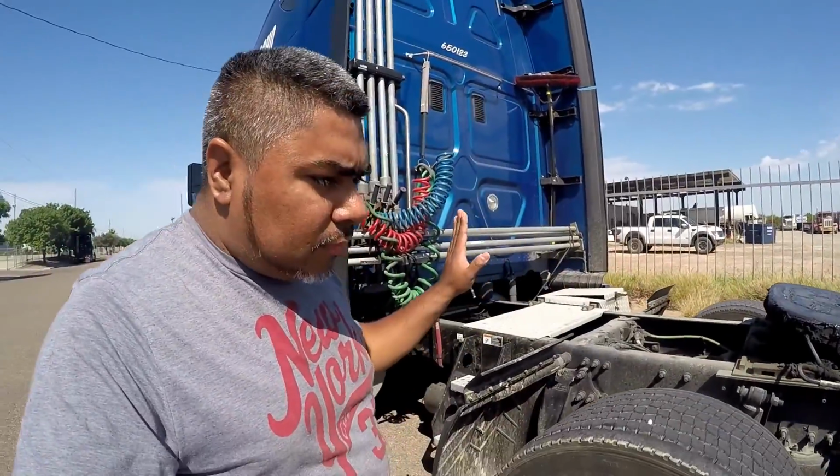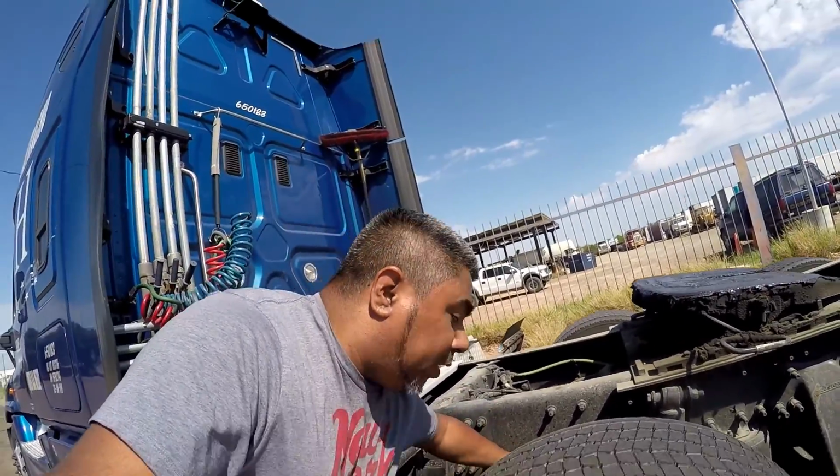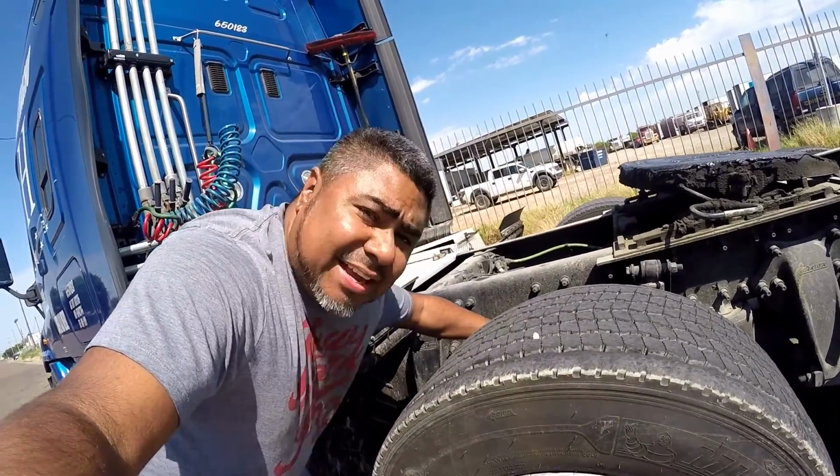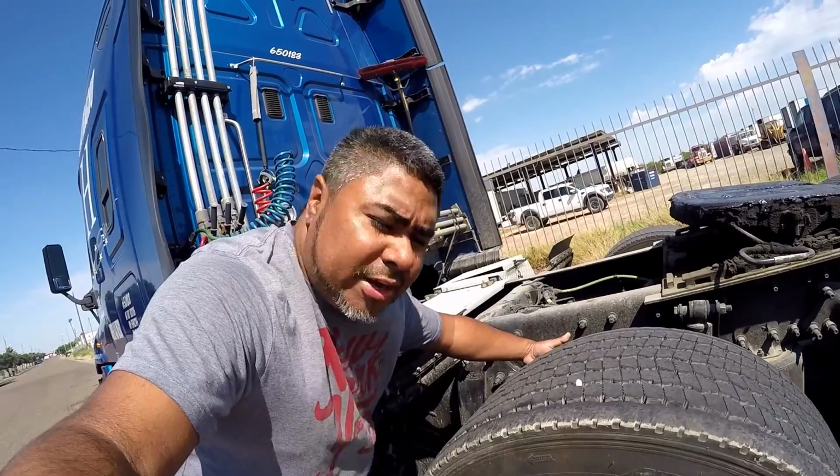You come back out here, you're going to be right next to the trailer, and then you're going to be talking about the brake drum, the brake lining, the drive tire. Then you're going to be talking about the rim and so on. Brake lining, the brake drum, make sure it's properly mounted, secured, not cracked, bent, or broken. As long as you point, you can point down there inside, he'll know you're talking about the brake lining, brake drum. Brake lining, make sure it's properly mounted, secured, not cracked, bent, or broken, free of oil and debris, and the friction material is not worn dangerously thin.